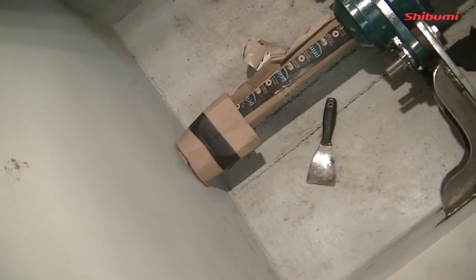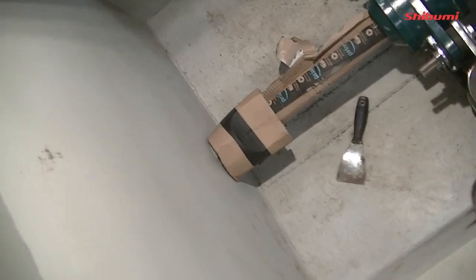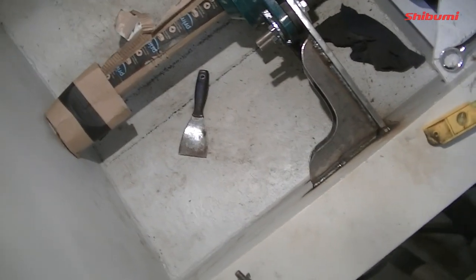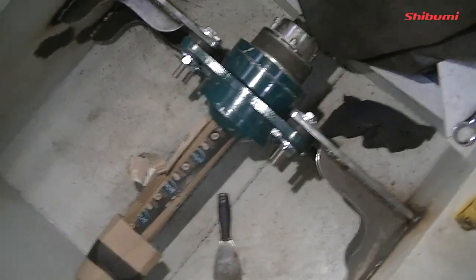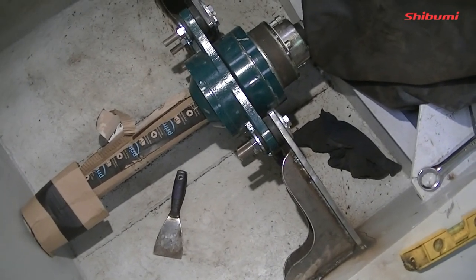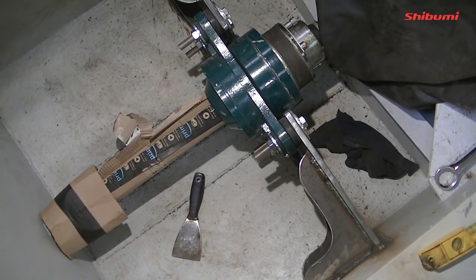So you can see there, I just protected it with a bit of cardboard just to stop any spatter landing on the stainless shaft. And the bronze coupling, or the bushing at the back, so it all remained pretty unscathed from the welding. But it's all done, and just to sand it out now and then repaint it. But the next job we'll be doing now technically is shortening the shaft to its new length, which is basically the end of the forward side of the CV joint, just meets there within a millimeter of it. We draw the shaft, do the measurements, and then send it back in.